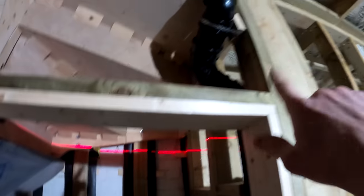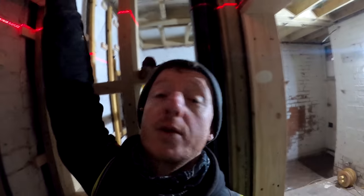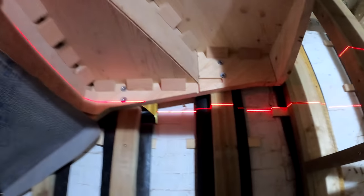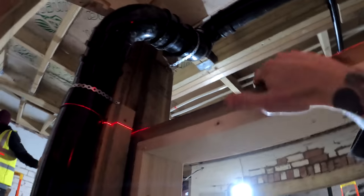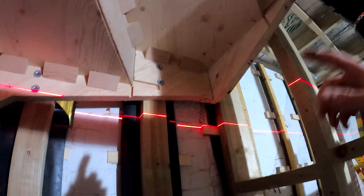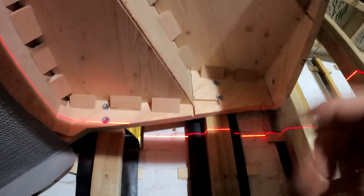Next up I'm going to be in the cupboard - the cupboard of doom. I'm basically going to put a false ceiling in here. Two reasons for that: first, we've got this nice four-inch pipe in here. Secondly, nobody is that tall that they need more than this ceiling height in a cupboard. And three: it's going to make my life a lot easier with plastering this, because we can then just come up from here and flatten this out across here. It's not that I'm lazy, it just makes life easier and it's going to be a nicer finish - it's just going to be really awkward and look a bit fussy otherwise. So you can see I've cast my laser line around here now, that means I can sit my timbers on top of here and get an architrave on the inside perfectly well. I'm just going to use some 2x2, brace that straight across, and then get that boarded.